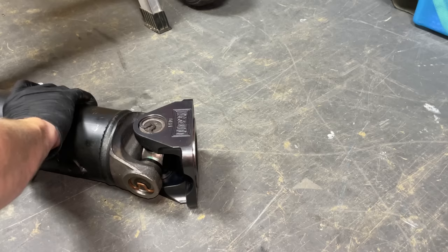We need to slightly limit the front suspension travel, so these are the limit straps here, and I think if we just move them up a couple of holes, that's going to do it. If we look down here, see the drive shaft? It's been slightly rubbing just up here, look, on full droop. So we need to just limit that just a little bit. Or we could just notch a little bit out here, maybe. We'll see. On the rear, however, I think we need more droop.